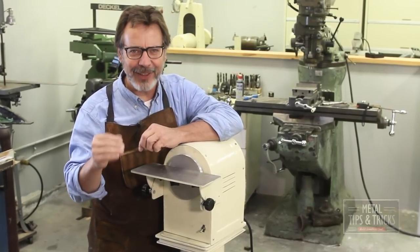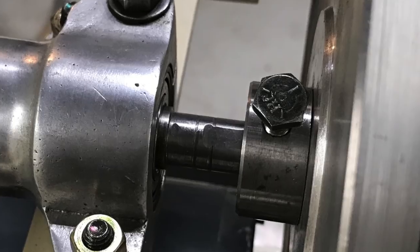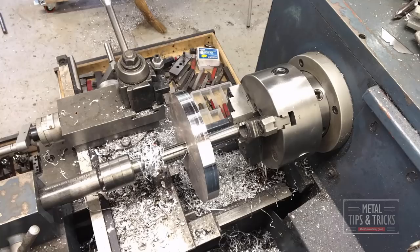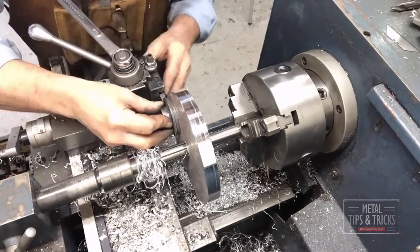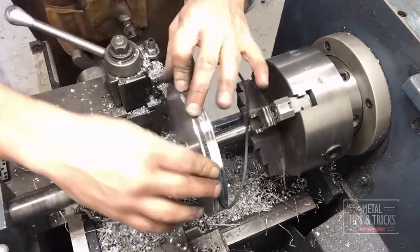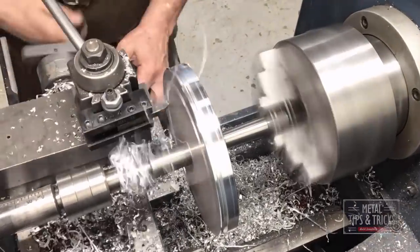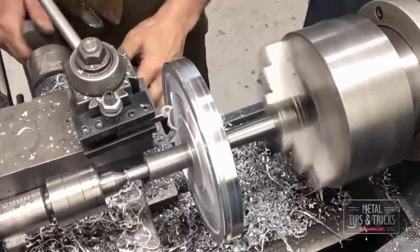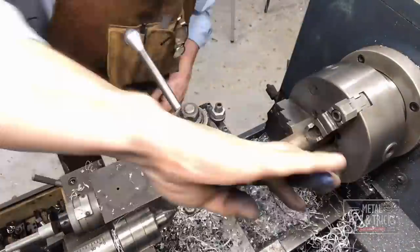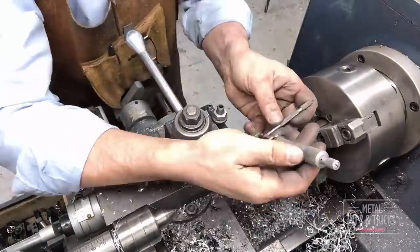At the end of the day I realized that I actually needed to have a steel hub in the center of it so I had a way to clamp it to the shaft. We switched out to a three-jaw chuck, put in an adjustable arbor for the center, and we're going to turn the outside and then set up the groove for that small V-belt. Here we're just making it look pretty, putting a little boss on that. Now we're working on the shaft that's going to be pressed into the center of that six-inch pulley.